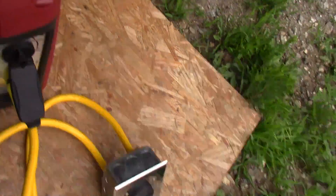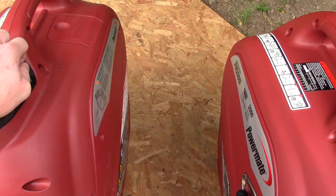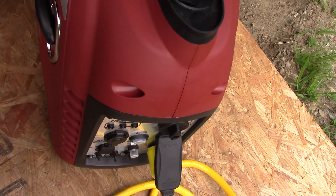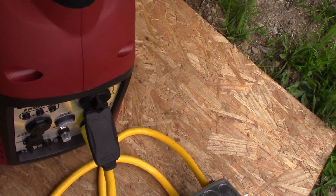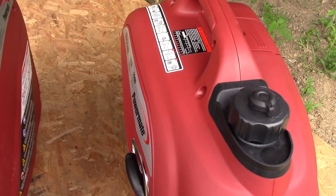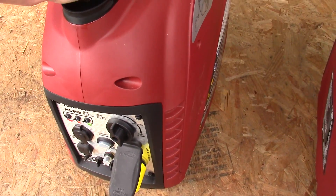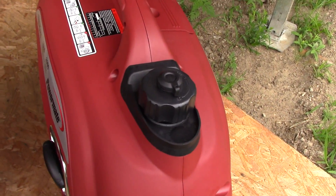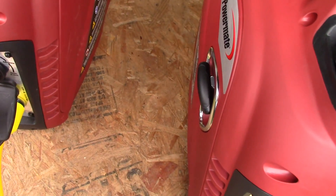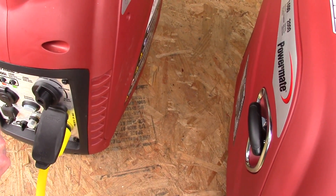We're at the two gen sets — it's pretty much that simple. You basically plug both of these in with both generators off and ready to be cranked. On the PowerMate specifically, this economy mode — you'll actually want to set that to off when you initially crank them. Sometimes I'll leave this unplugged and actually crank both units up and let them warm up before doing the parallel, because it does take a bit of energy to get them synced up. They definitely will not start well if economy mode is on when they're cold.